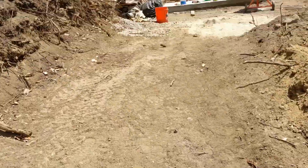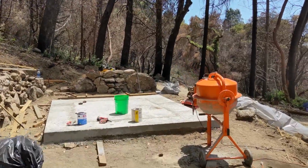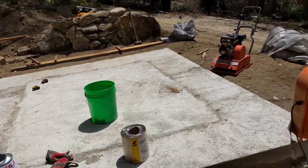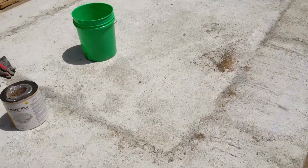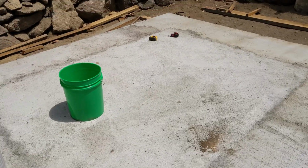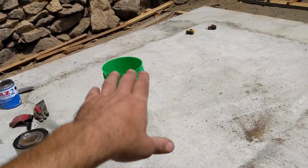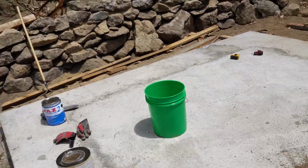So moving on, back to the little road I created up here. So this is a 10 by 12 foundation that I put in, kind of by hand. I didn't really know what I was doing, but YouTube and all. So I did an outer perimeter, probably 4 inches, and then 2.5 inches in the middle, because all the hempcrete footing is basically going to be on the outside.